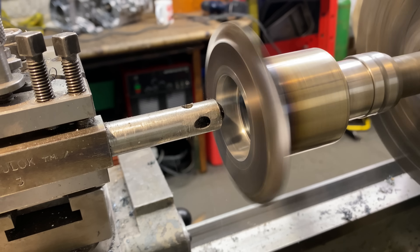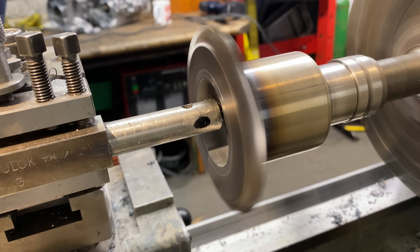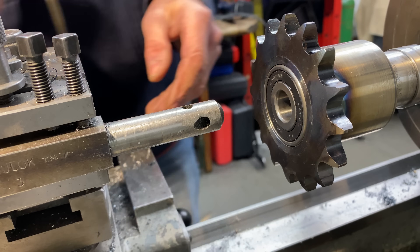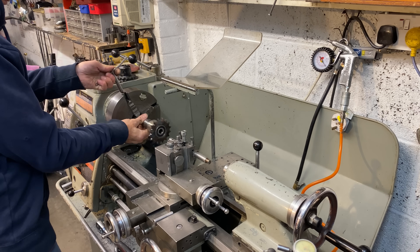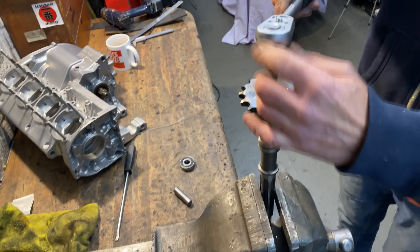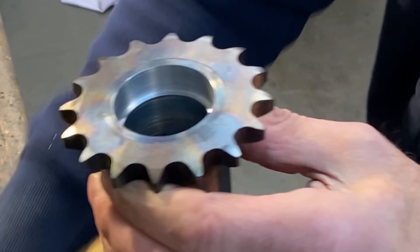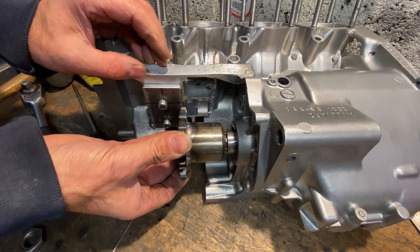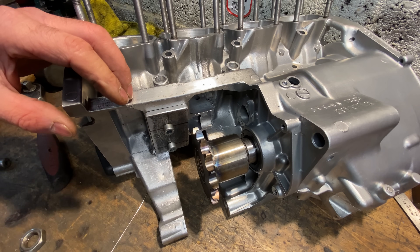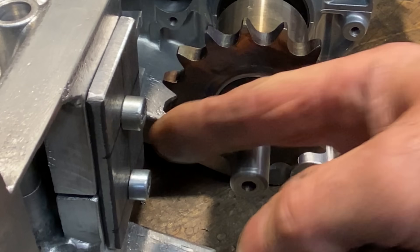I can feel it just starting to go in, so the next cut will be perfect. The outrigger bearing slides in just right, so now I can remove the shaft from the lathe, put it in the vise, undo the big central nut, and take off the sprocket extension to try it on the engine for the first time. It fits perfect, just what I wanted, and when I measured it with my rule it was 48mm offset — so that's just right. Now I can finish off the outrigger bearing support bracket.